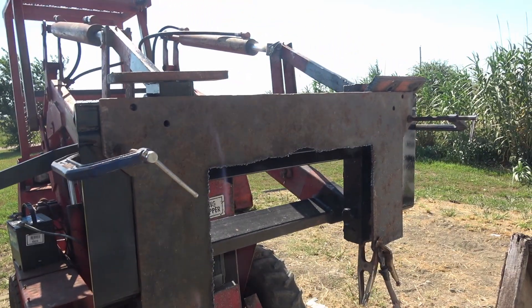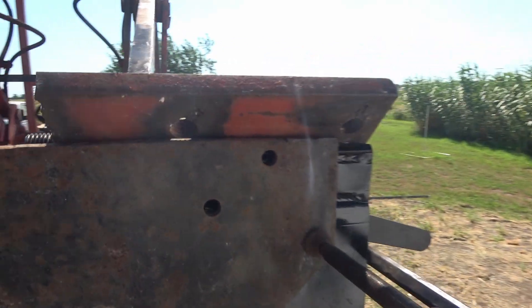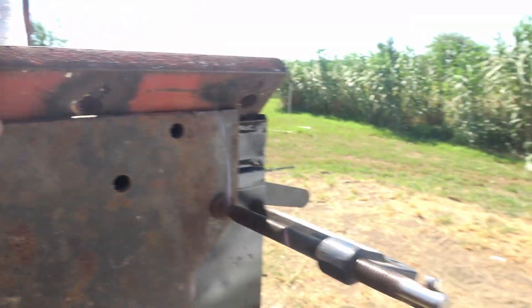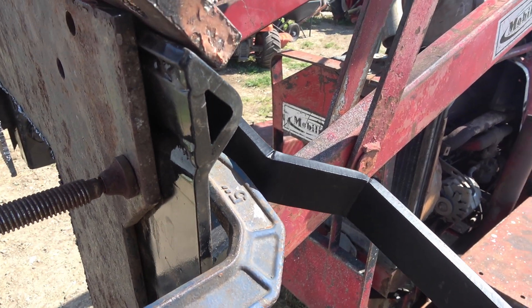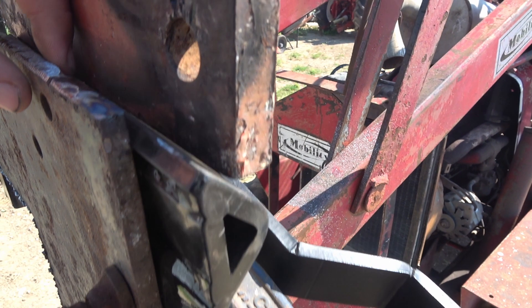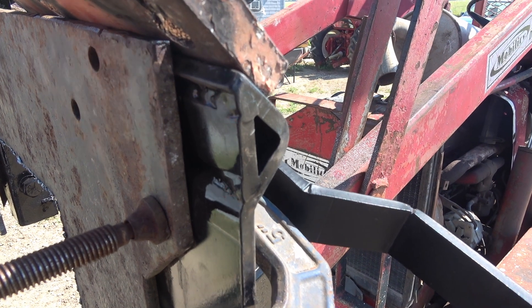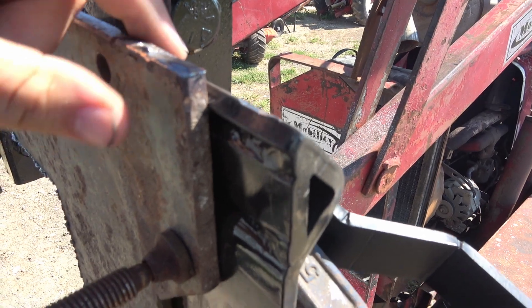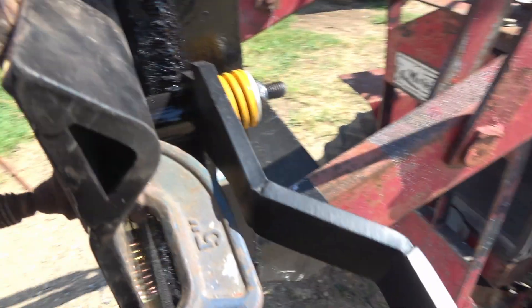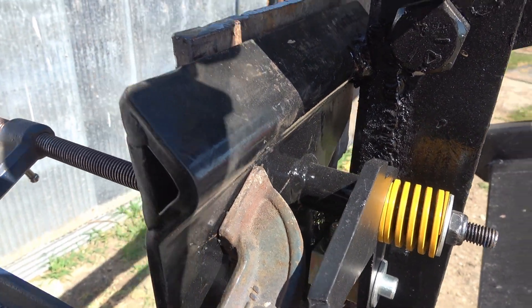I've got my piece of sheet metal clamped up here to the front of the skid steer quick attach, and these are the blocks of steel I'm welding up on top here. You can see the overhang here - that's what's going to hold my attachment on. I have this spaced out so that the plate is raised up high enough that I can weld on the inside of this all the way along, so that weld should not interfere with the plate. I can just run a bead along the inside and it should not interfere with anything.